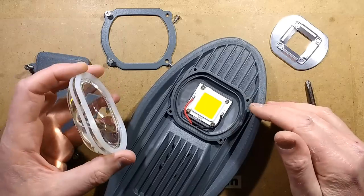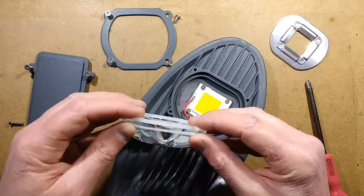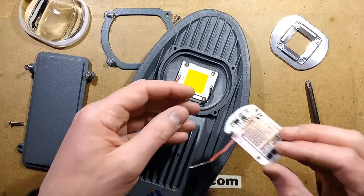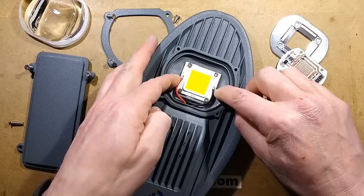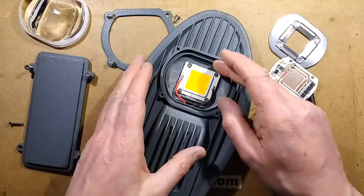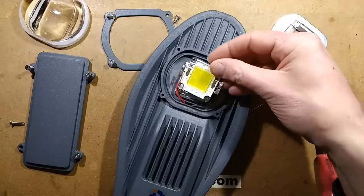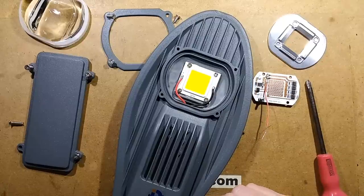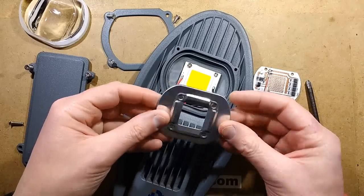There's also a silicone seal underneath which goes onto the compartment — so two layers of silicone, possibly to allow even clamping. Technically, you could probably put a driverless chip in there if the spacing is the same. It's domed, but there's a little aluminum plinth that the LED sits on. So it's very serviceable — you could put in standard LEDs or one of the driverless ones if you wanted. The driverless models will probably start coming out since they're simply cheaper.